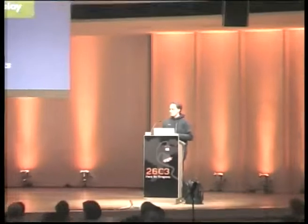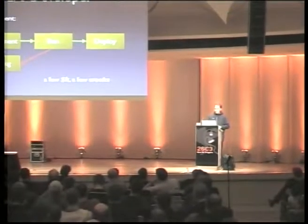And you will debug the board, and you will either find that it works as you think it should work, and then you can ship it, or you find some bugs, and you will again try to understand the bugs and change that in the implementation, like fix the schematics or fix the routing or the placement or whatever, and then you do another run, which costs another few $1,000s. It is pretty much okay if you don't need that many revisions of the hardware.